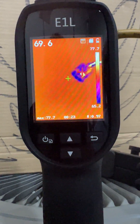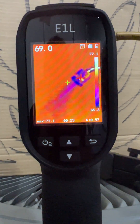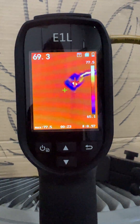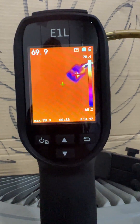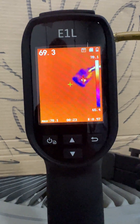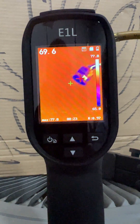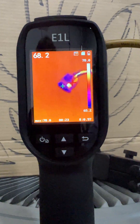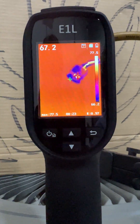You can see there a small amount of trace vapor, and I'm going to go ahead and get it right to where you can just hear it and start to throttle it back. You'll notice that when I shut it off, there is no refrigerant falling out of the hose, and that's because it's just like when you put your finger over a straw full of soda pop — the vacuum creates a place where the refrigerant really can't go out, and the air can't come in. Additionally, there's vapor pressure that's pushing a small amount of refrigerant out.